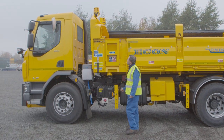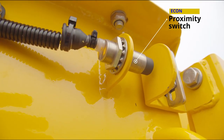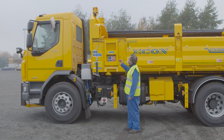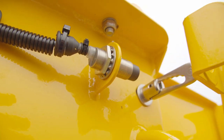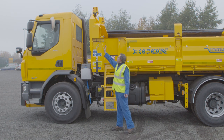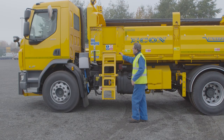The safety systems on the unibody include a proximity switch on the ladder. The proximity switch has an LED on it — when the LED is illuminated, i.e. the ladder is in place, the auger can be used. When the LED is not illuminated, which happens when the ladder is dropped, that will immediately cut out the auger. If the LED is never illuminated with the ladder in place, there is usually a fault on the proximity sensor itself and that would need replacing.